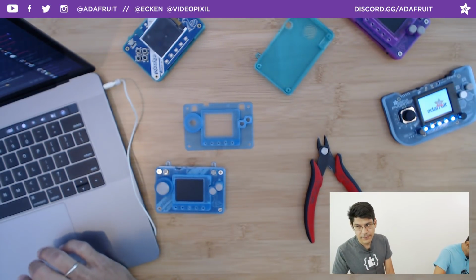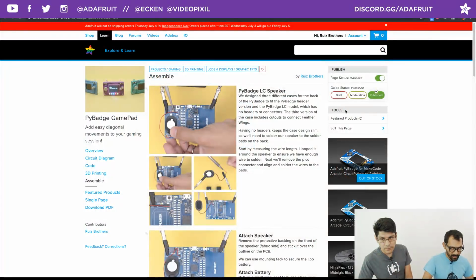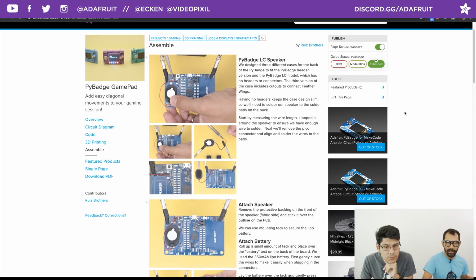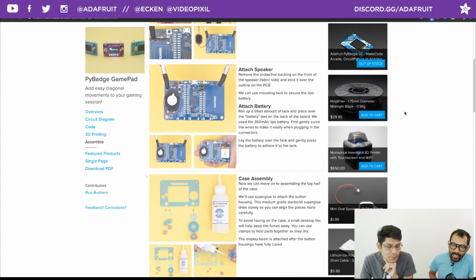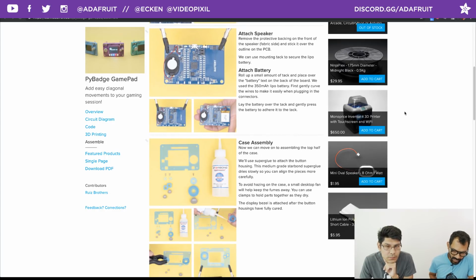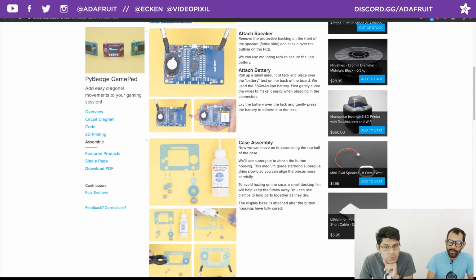Cool. All right, next page is the assembly. It's pretty easy, except if you're using the LC model, in which case you're pretty much just trimming the wires on the speakers to fit. I just show you there how to hook those up. And as we were saying, definitely third helping hands will help to keep these elevated and make sure stuff's not moving around. The oval speakers that we carry have 2 sticky components on the back and in the front. To avoid any leads touching, we're going to use the fabric, what I call the front side. And there's a little sticky protective film that you just remove and line up with the little outline that's on there, stick that on.